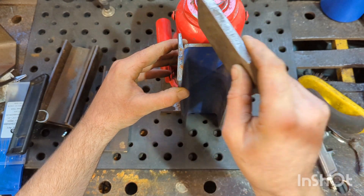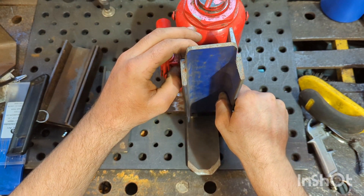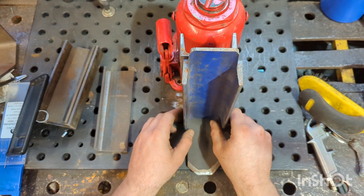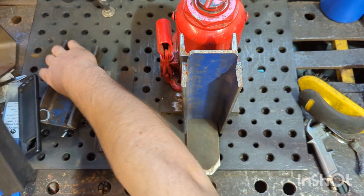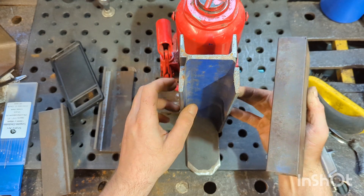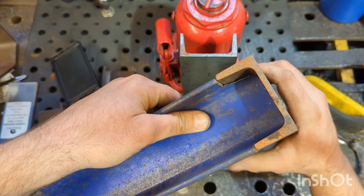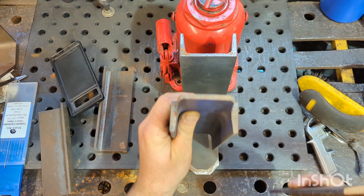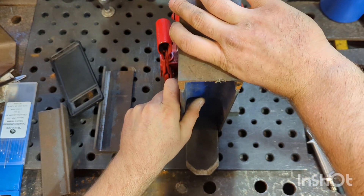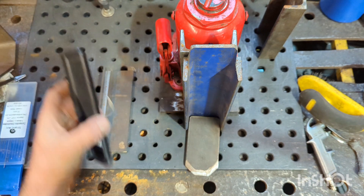I think I'm going to double up the thickness — that's 10mm plate — and I'm probably going to put another layer of 10mm plate along the bottom, to make sure the toe itself doesn't bend when I'm trying to lift a tonne-and-a-half machine. I've also got this section here which will join the lifting leg that attaches to the toe across the top there. I've also cut that so it fits nicely into the C-channel, and I'll weld around all the seams I can get to, so that's going to give us a pretty sturdy lifting leg for this toe jack build. I'll put you on the time-lapse for the welding and catch you after.